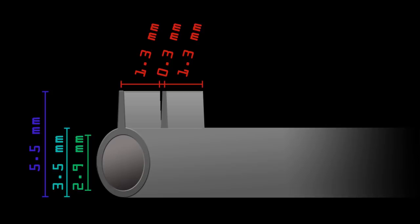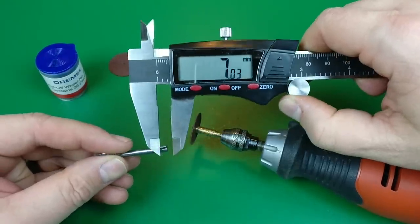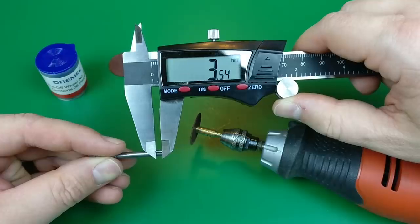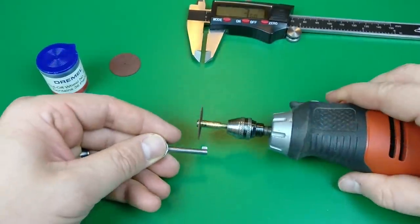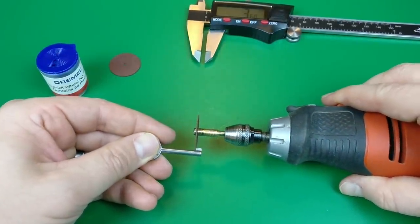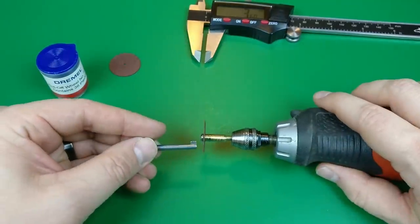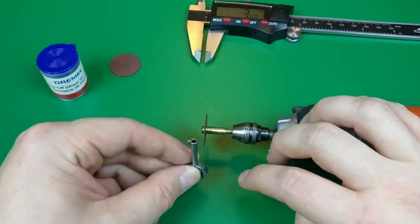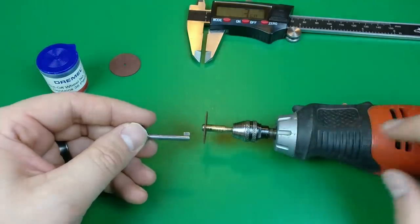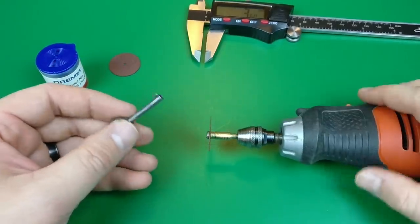Here are our original diagrams from that DEF CON talk we did so many years ago — pretty easy to follow along. So we've got a bit that's just a little too oversized, coming in at three and a half — we want to lose about half a millimeter. There are a couple of ways to do that: you could shave from the left side of the bit, it's less work. However, I tend to like to come from the other side, because it gives the entire front face a really crisp squared-off 90-degree edge. Nothing to it but to do it — engage your safety squints.